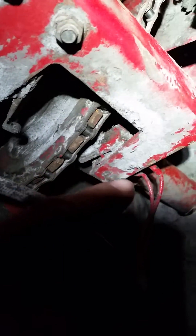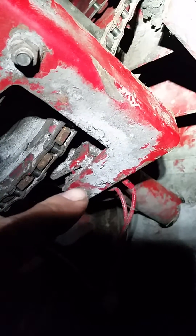It's kind of tight in here, forgive me for the camera bounce. There's a limit switch here and there's a limit switch on the other side of this pulley, which rotates to change the diameter on this sheave. Basically what you want to do before you take that motor out is make sure these limit switches are working and connected — this one over here was disconnected.